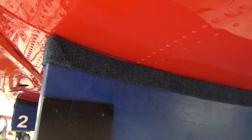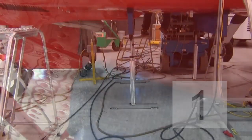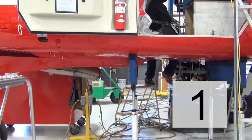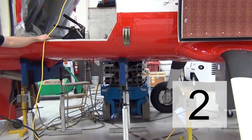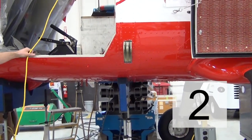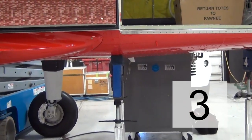The contour board should be padded with 0.5 inches of felt and covered with canvas duck, carpet, or equivalent. Locate the shoring cradles at the proper support locations as called out in Chapter 7 of the maintenance manual. One very important note: the shoring cradles should only be placed under the fuselage frames and never under an open bay, in order to protect the skins from damage.